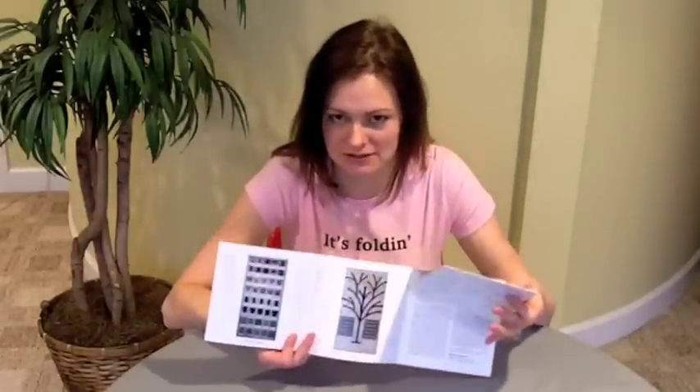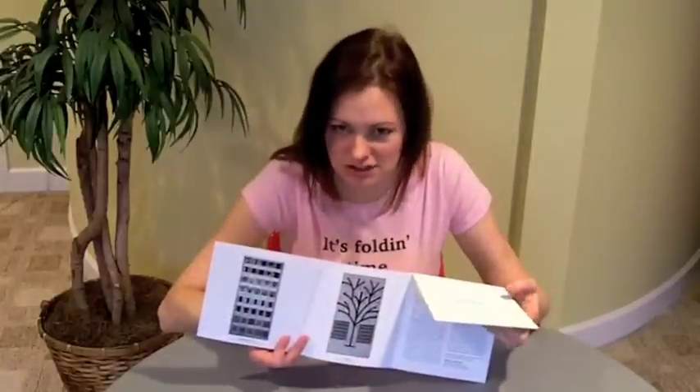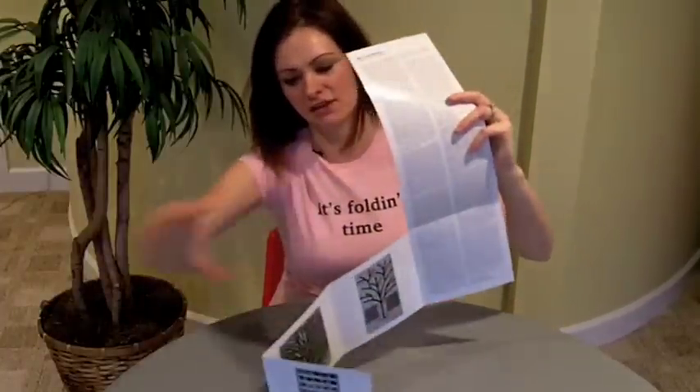What's nice about the L in comparison to an iron cross fold is that iron cross folds are notorious for not being able to nest well together, so you can't get more than one on a sheet generally — you've got a lot of waste. With an L shape, you could likely nest another one in, so you might get two on a sheet with this one.